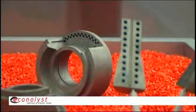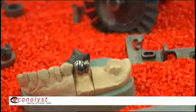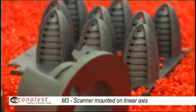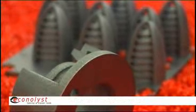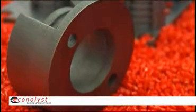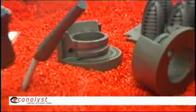The M1 and M3 actually have the same laser system inside. The major difference between M1 and M3 is that the M3 is modified so that we can pulse the laser — run it in pulse mode. So we can do engraving or laser erosion, laser removal with the same laser type. We also have some differences in machine design related to build envelope size. The M3 has one particular difference: the scanner is mounted on a linear axis so we can actually move the scanner over the build envelope. This allows us to have a short distance and very low angle while exposing the powder surface to the laser beam, ensuring the same accuracy while enlarging the build envelope.